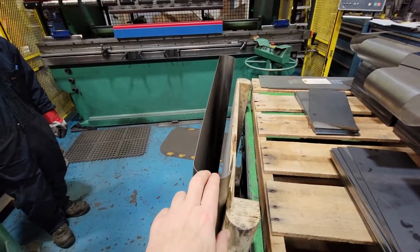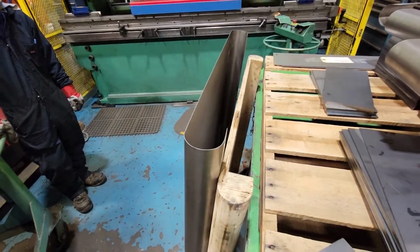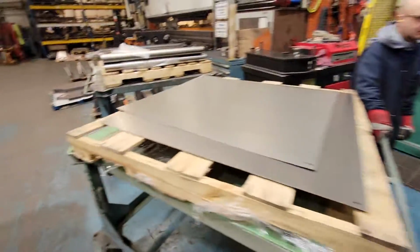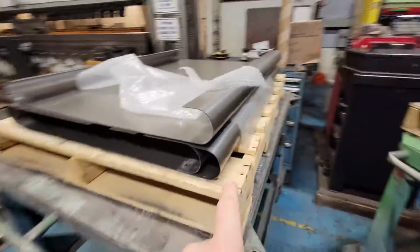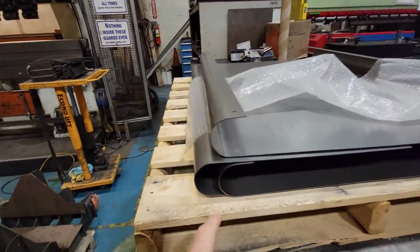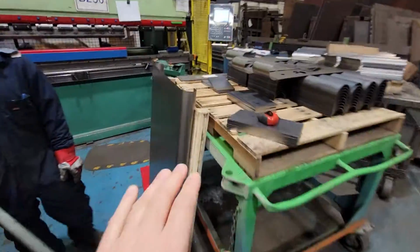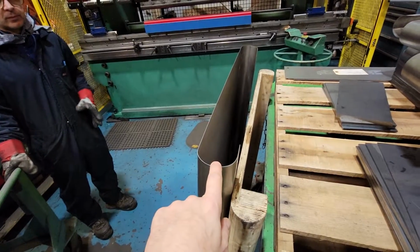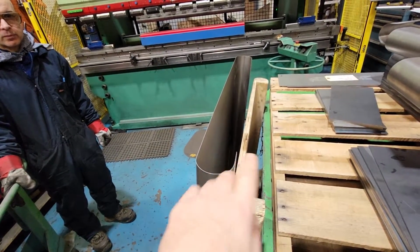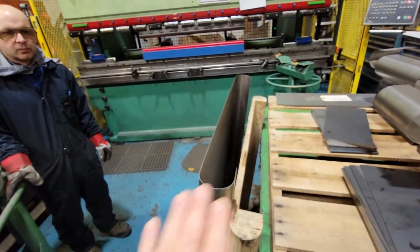We're not going to put these back in the press and try and re-squeeze them again. Does it make sense? I'm recording this for posterity in case you ask about why there's a flat spot. It's because the material does have some spring back, even with the special tooling, and I don't want to mess with it by trying to rework them, because then you might not get these on there because they're being smaller, plus the 6 pieces end to end might not match perfectly if I start messing with it.